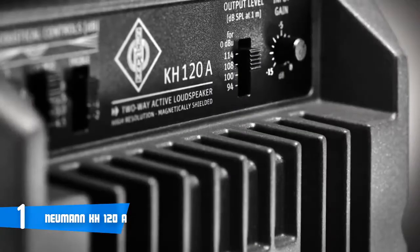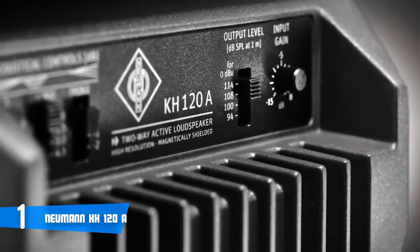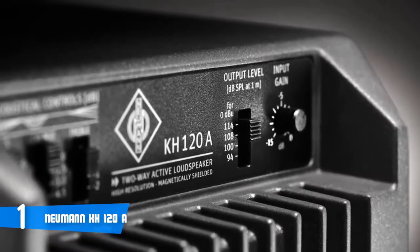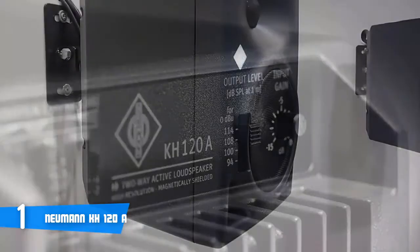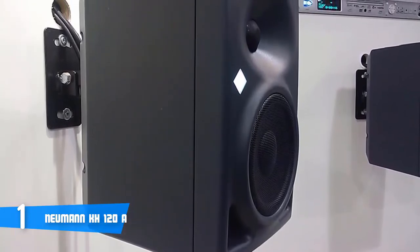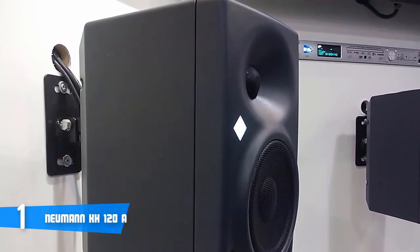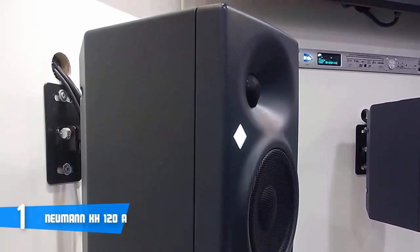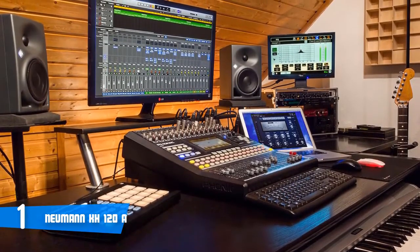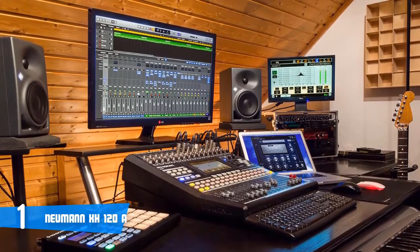Additionally, the drive units comprise a long-throw composite sandwich, 130mm bass mid-unit, plus a titanium fabric 25mm tweeter, with a 4th order crossover at 2 kHz, feeding a pair of 80-watt class AB amplifiers. To continue, the front baffle is quite a stout aluminium section bolted onto the rest of the cast aluminium cabinet, and is heavily shaped to pull the bass driver slightly forward, while on the left-hand side between the two drivers is an illuminated Neumann badge, which is smoothly backlit and white when the speakers are powered and flashes red if the internal protection system is activated.